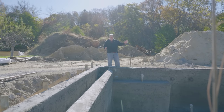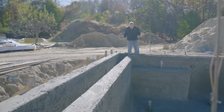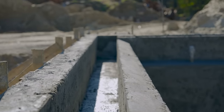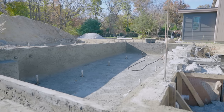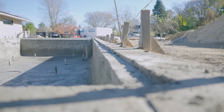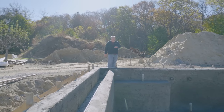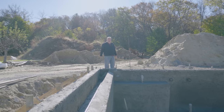Notice this trough at the end of the pool. For those familiar with pool design, this trough is basically going to house the roll of the cover. You can see the beveled edge on the front. We'll have some nice coping stones, the grade will get brought up, and this will all get finished nice and neat. The trough houses the pool cover, and down along both sides of the pool there's a little recess for the rail. You'll be able to go inside, hit the switch, and the pool cover will close or open. It rides along those rails and coils up here in that trough.